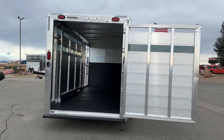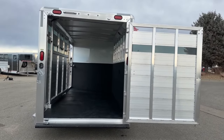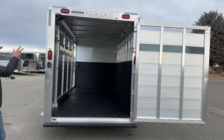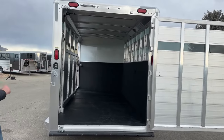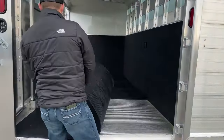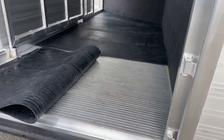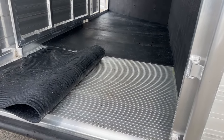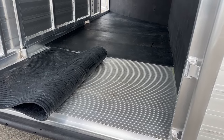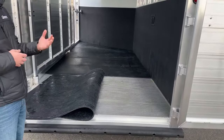Here on our load side of this trailer, it is a full rear gate with dual plexiglass track. We have an eight-inch awning light up high. Switches are located on your left panel back here — your left header — to operate your outside lights as well as your stall lights. Before we jump in, it's worth noting: this is a four-inch centered aluminum floor with a V-truss center and interlocking channels. Typical trailers have 10, 12, or 16-inch centers. This is every four inches with a center running the full length of this trailer, so no matter where a horse stands, they're standing directly over a support beam.